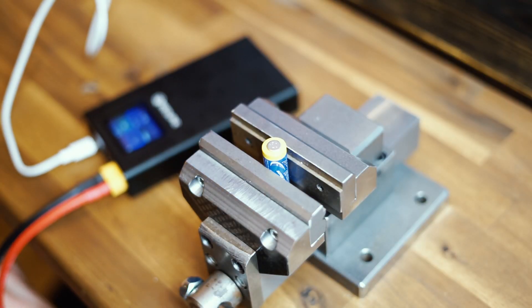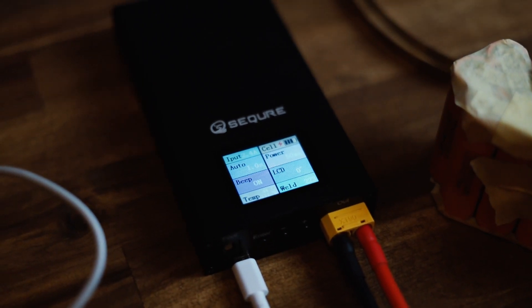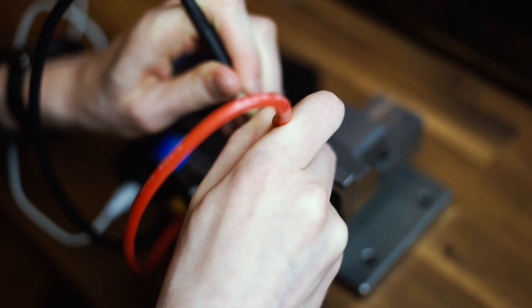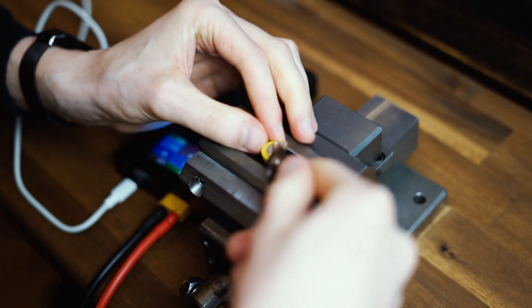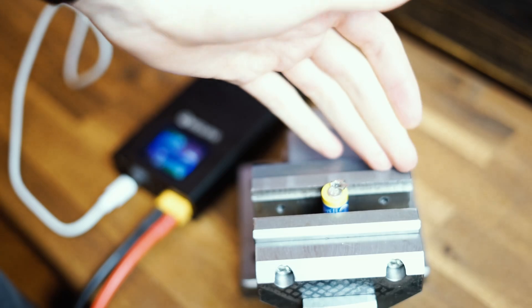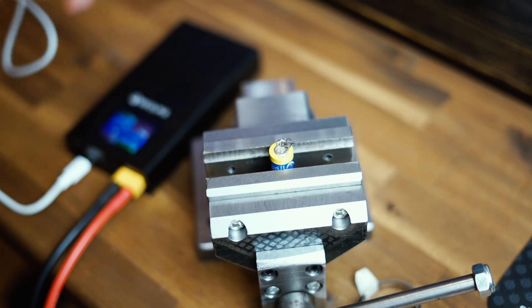Let's try welding again. I have now charged this thing up pretty well. We can increase the power to around 30 milliseconds or something. That looks pretty well — basically rips out all the nickel when you pull on it, and that's basically how it's supposed to go. So something around 30 to 40 milliseconds, and charge this thing fully up before you start — it really helps out.